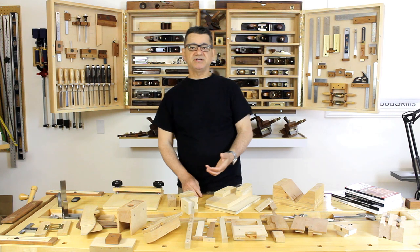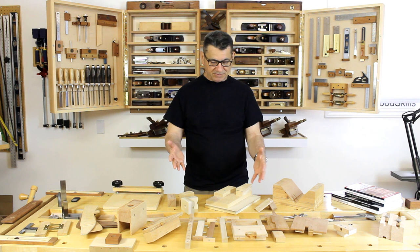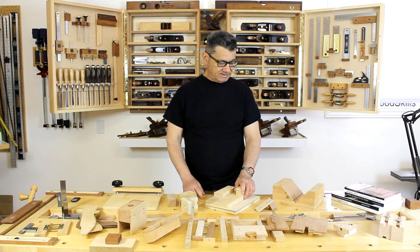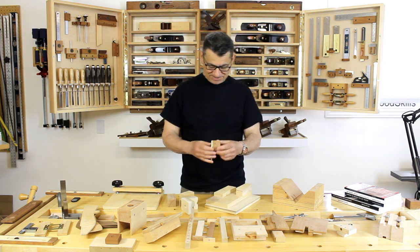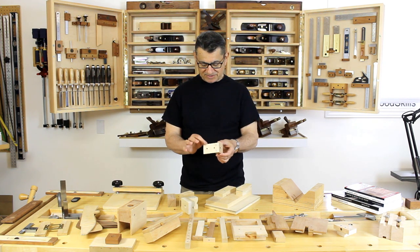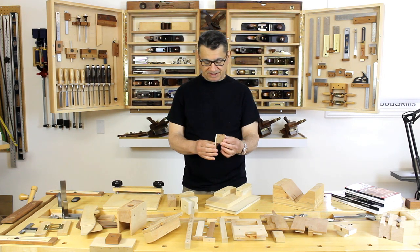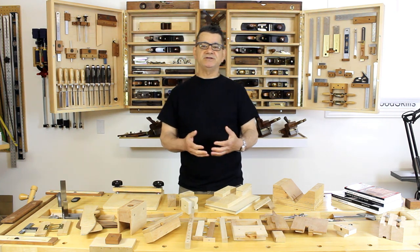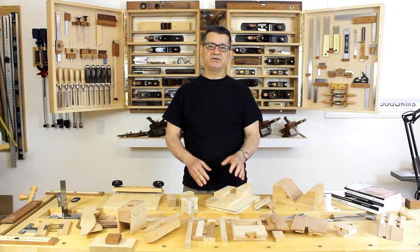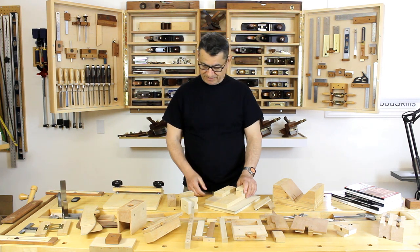The best material for jigs is veneer core plywood such as Baltic birch ply, and that's what I predominantly use in my jigs. But I also use a lot of offcuts, and of course we all have offcuts in our work. You can see an example of the combination of a small veneer core plywood with a piece of offcut. This is a drilling guide that clamps to the side of a furniture piece. It's just one example. Using dimensionally stable materials ensures that the jig is accurate, is easy to use, and remains accurate throughout its life. I can attest to this.